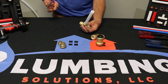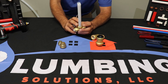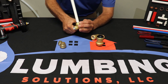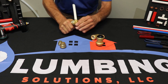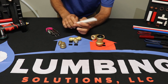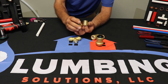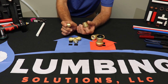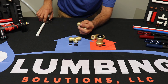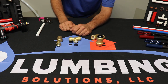The other cool thing is they're removable. They used to have a little donut thing you could push down on to pop that out, but now they've got a really neat tool — you just put it on there, push down, and that pipe comes right out. What I like about these caps is that if you ever have to make a repair and need to cap it off temporarily, you use this cap, and when you're done you pop it apart and put it back in your toolbox to use later.